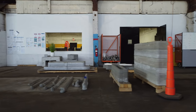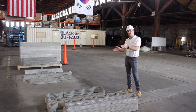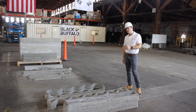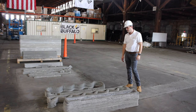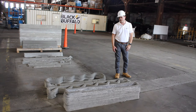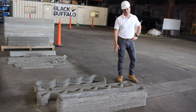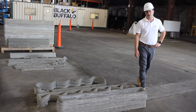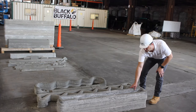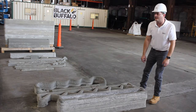We've continued to do experimentation with different wall shapes and configurations. We do an inner and an outer wall connected. Initially we were doing a zigzag shape in between, and you might see that on some of the videos or leaked footage online of our printers. We actually came up with a better, more affordable way. Everyone in the industry counts on 3D construction printing being more affordable — we're setting out to prove it's not only more durable and more resilient, but you can eliminate a lot of the cost by just printing the outer and inner wall and planning ahead in the CAD diagram.